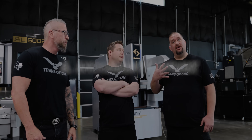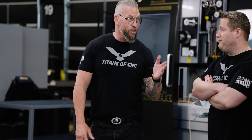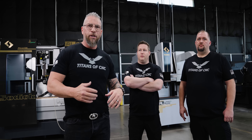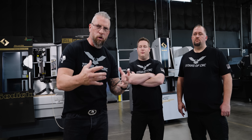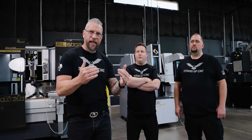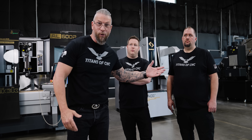Number five is incorrect work holding. So what we're talking about is you're CNC machining and you have a vise, or some type of work holding — a chuck or fixture — and you're not holding your material correctly. Thus it is either vibrating or the material is pulling out, which can break your tool. It damaged windows, as Barry knows.